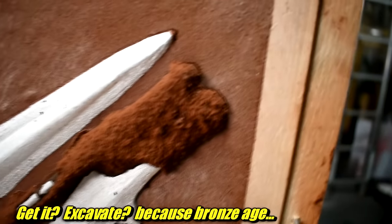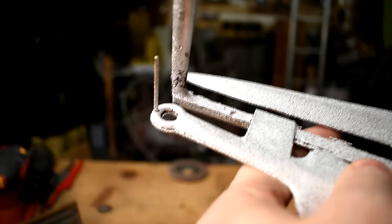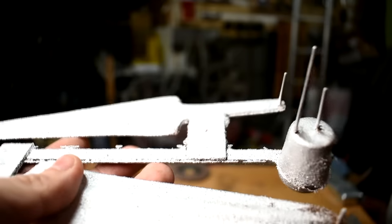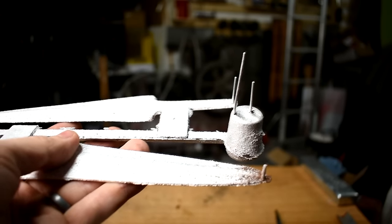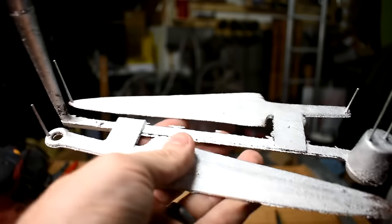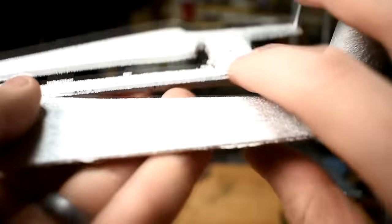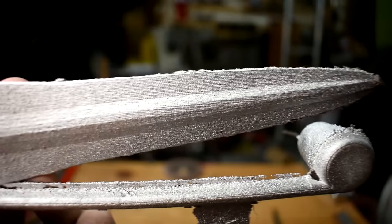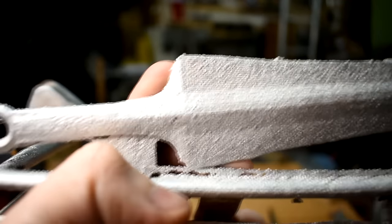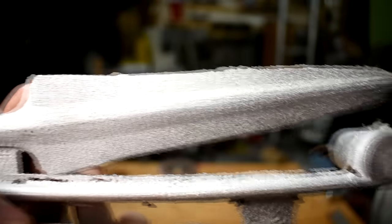Another copy of that original one — going to excavate my new one and see if it actually came through. Hey, look at that — it did indeed fill the whole ring, and a bit of the vent, and I got the spin trap and the pouring basin too. One of those ingots really goes a long way. You might think one pound isn't a lot of metal — it's a lot of metal. Up close, this was the side I cleaned up — you have a clear sandy texture. And on the other side, layer lines. So even if you don't clean off the layer lines on the print, they'll just look the same on the cast. But still, looks pretty cool. It's definitely spear-tacular, if I do say so myself.